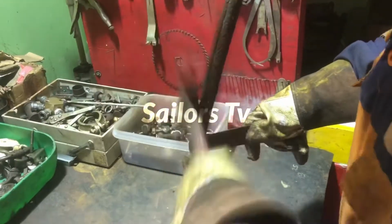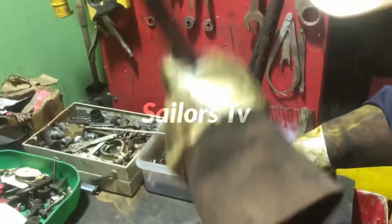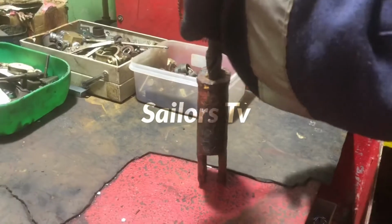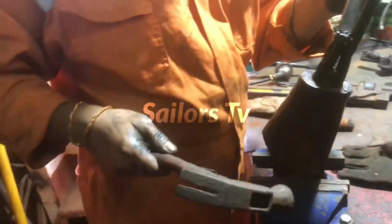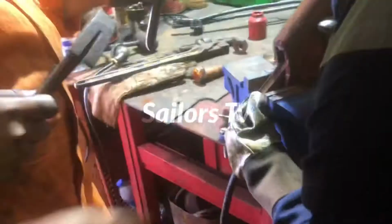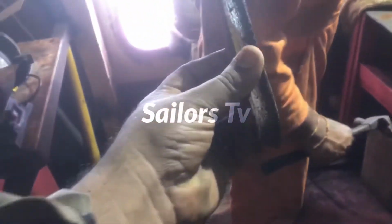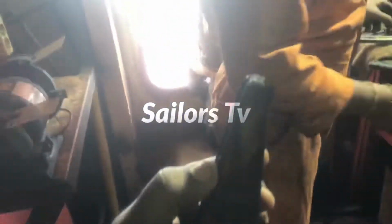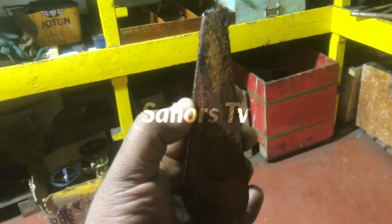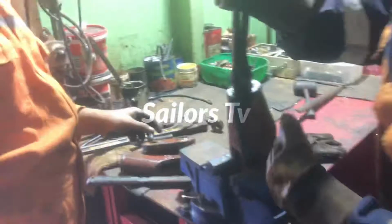Now the rope is almost come inside, means all the ropes have been taken onto the drum. And so one end is inside the drum, and another end we are going to make fast by using this. So we are removing this distance. It was very tight because so much of weight has come onto it, and this thimble piece has gone inside so much. And this is how it is, the locking pin, and the sides are there for a rope to pass. I mean the tapered one, the curved ones on the sides is there for ropes to pass, so that it won't get damaged.